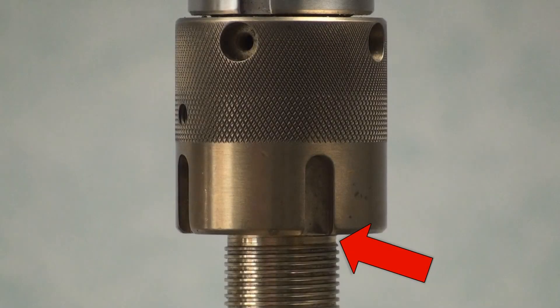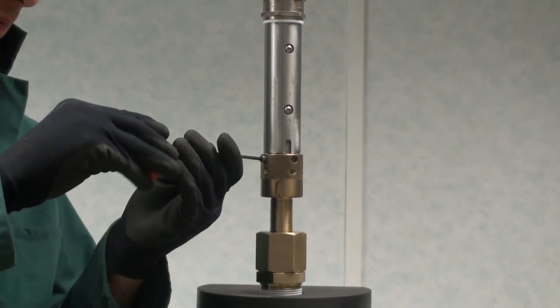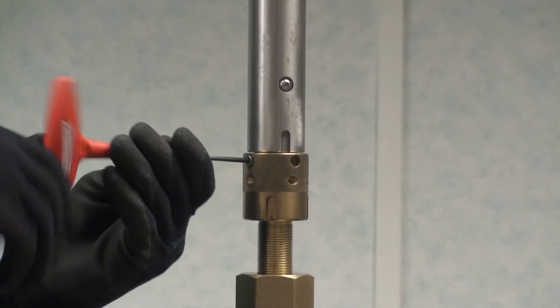To verify the engagement, the lower edge of the surface connector should sit parallel with the groove machined into the thread of the flexible connector. An electrical test should now be carried out on the completion. To prevent the surface connectors from being accidentally removed, fit the M4 cap head screws.